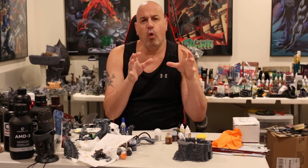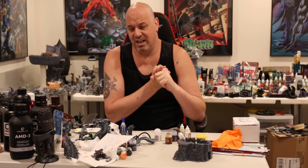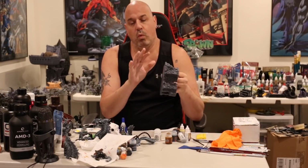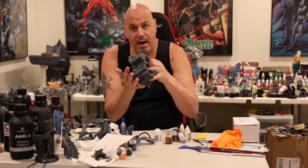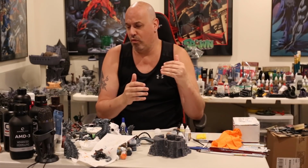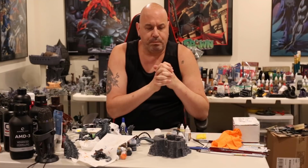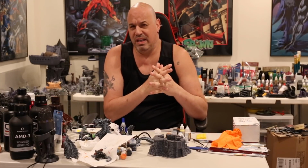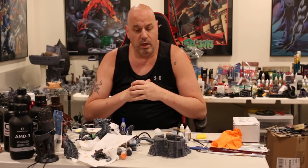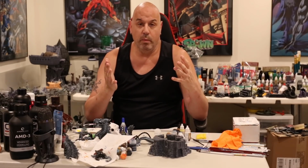I know some people think when you have holes in the build plate, two things can happen that might be bad. One is that resin can get cured in the holes and get stuck. For me, in all the prints I did while I was testing, where the supports were over the holes, when I popped the supports off, that took any resin out that was cured in the holes. So I don't think the holes getting cured resin in them is really going to happen. Doesn't sound right to me. I don't think you have to worry about cleaning those holes. That's my take on it. I know other people may feel differently, but I don't think the holes pose any problem, to be honest. I think they do sell a totally flat build plate with no holes if you want that, but then you will be increasing your suction forces.